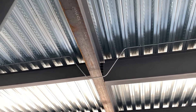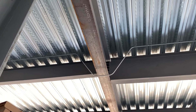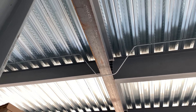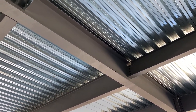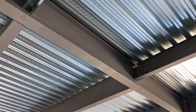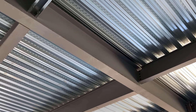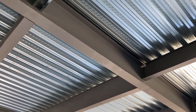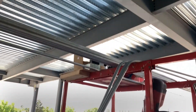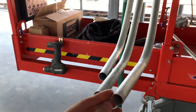Welcome back. Today I'm going to show you how to bend some pipes that look like this example. I'm trying to bend pipe around these beams, leaving a coupling in the middle in case the sheetrockers need to pull it apart and slide their sheetrock in. It's basically a four-point saddle with a cut in the middle. I've got three of these done and I'm going to show you the last one, done slightly differently.